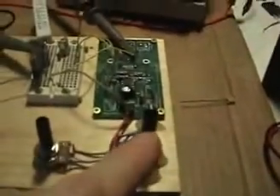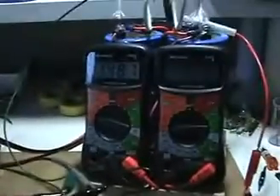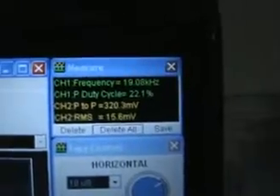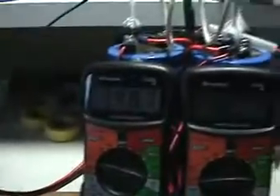Dropping it lower, the effect stops as well — that was only a small change in duty cycle. Now, rather than adjusting the frequency pot, which is very sensitive and takes a while to tune, I'll instead insert a capacitor in parallel with the existing capacitor to change the frequency. As you can see, the charge is going back and we're in a more ideal condition at 19 kilohertz, 22% duty cycle. I'll insert that extra capacitor now.